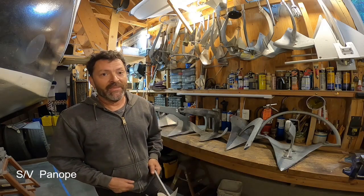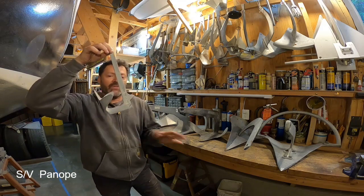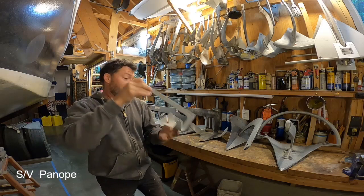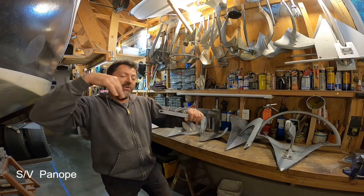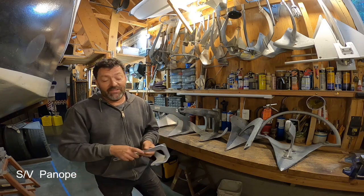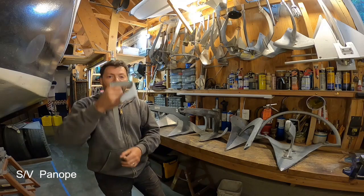This would be most applicable in waters where you can visually see what the anchor is doing and verify that it stayed away from the chain pile. The speed at which the chain is let out over the roller affects the anchors pretty severely — actually more than I had thought. In the initial drop, almost all anchors will hit the water with a similar angle, then tend to go back and start flying. However, if you keep the chain going fast, the chain will actually descend faster than the anchor. Once that happens with enough chain, it will pull the end of the anchor down and it will fly back the other direction — right back toward the pile. I even tested a situation where it flew beyond vertical and went the other way. In unlimited depths, I could imagine the anchor would oscillate back and forth, maybe ending up in a straight-down dive.